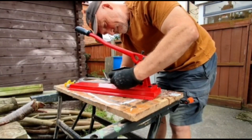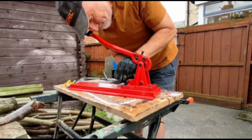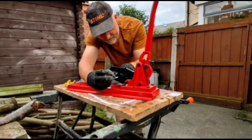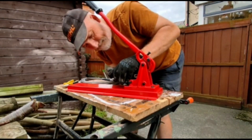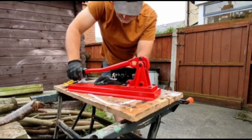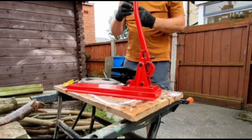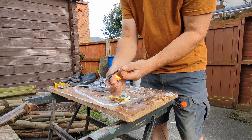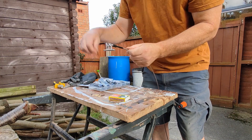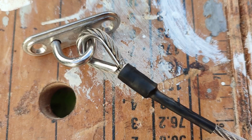For the rigging I decided to have a go at making this myself, so I ordered a crimping tool and some bits and bobs, and set about crimping my first thimble onto the pad eye which would attach to the top of the mast. This is a little bit fiddly but very satisfying when I managed to do it. Here I'm using a match to apply heat to some heat shrink and make sure that the finished assembly is nice and snag free.